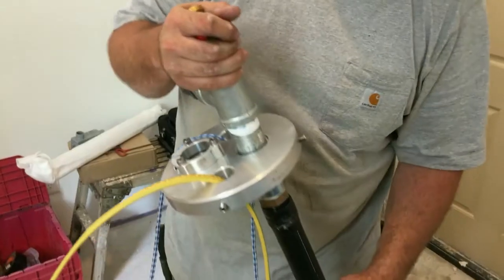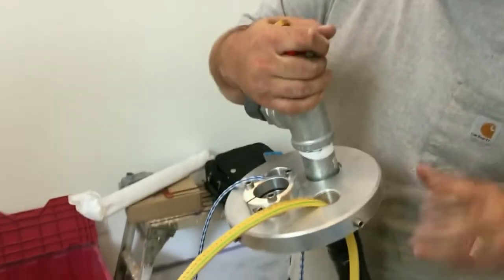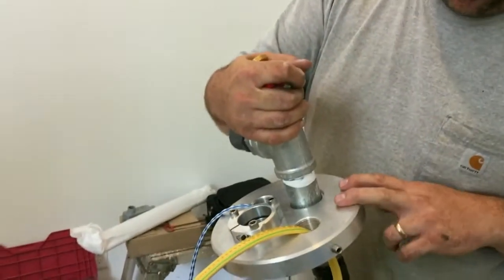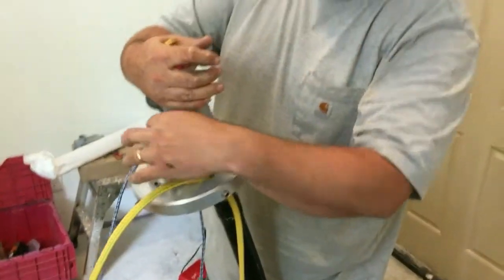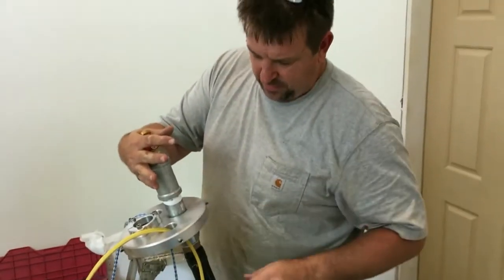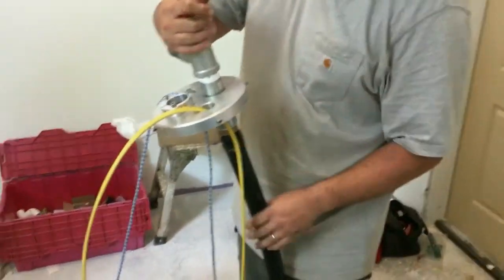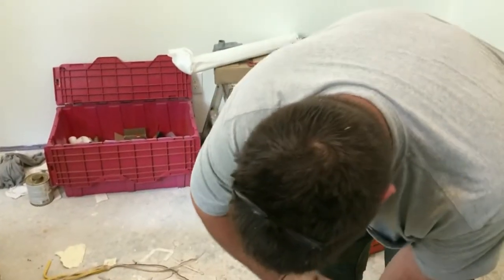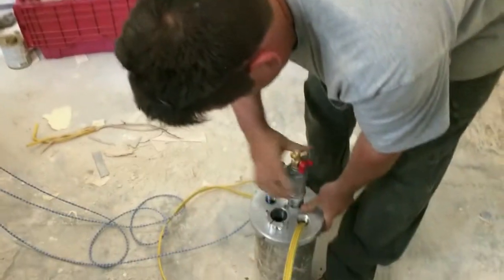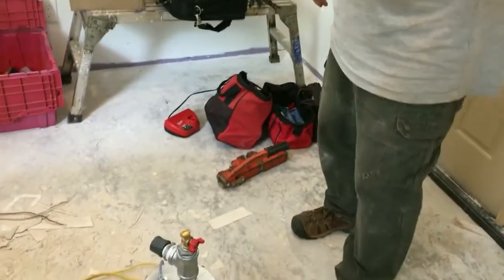Plumbing hard stack — what do you call that? Pop head? What's nice about it is the simple pump cap allows you to have the wires and safety rope. You can also disinfect through this port your hand pump and your submersible pump. We could have hung this on one-inch pipe but we went with inch and a quarter for plenty of volume. That is a 200 PSI drop plate.